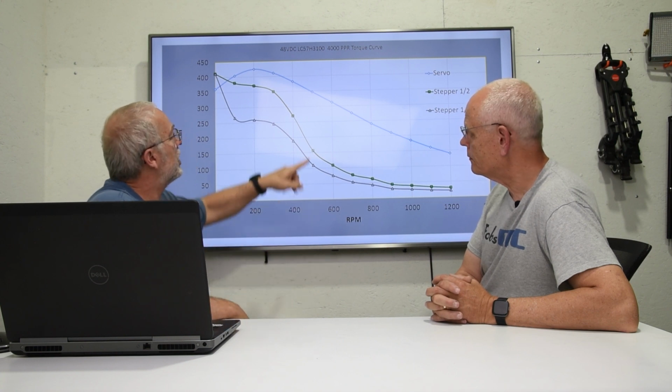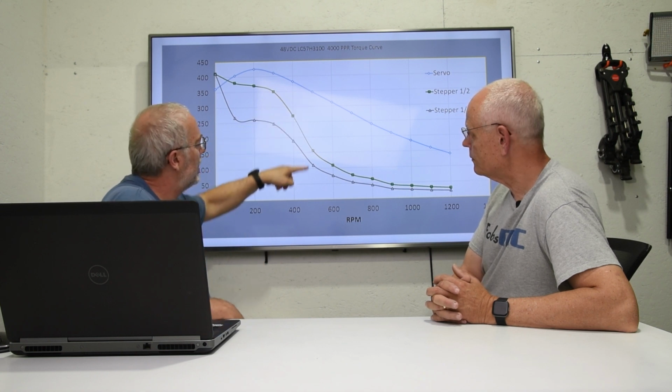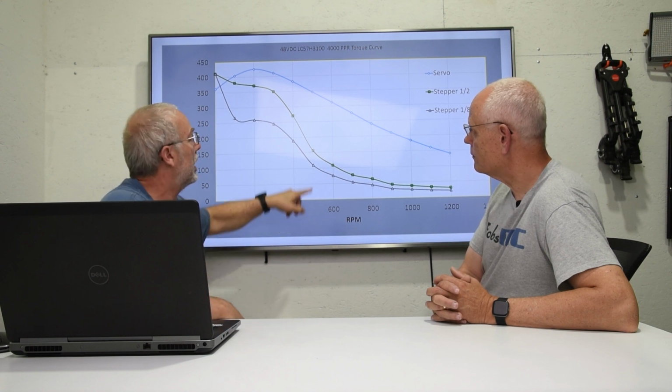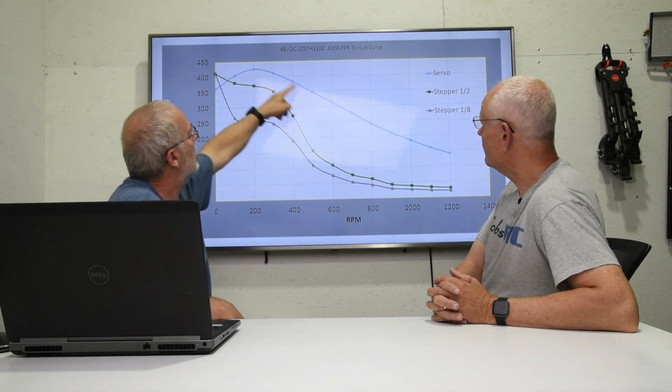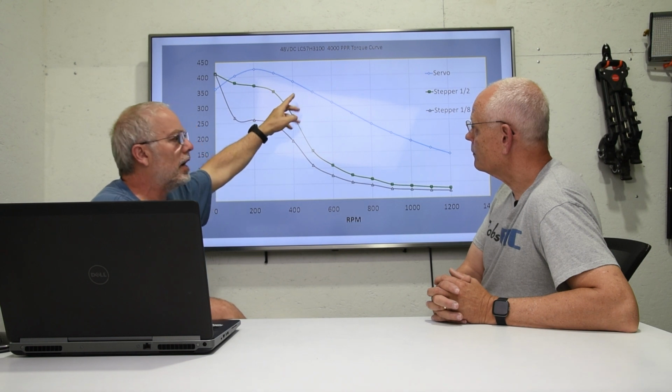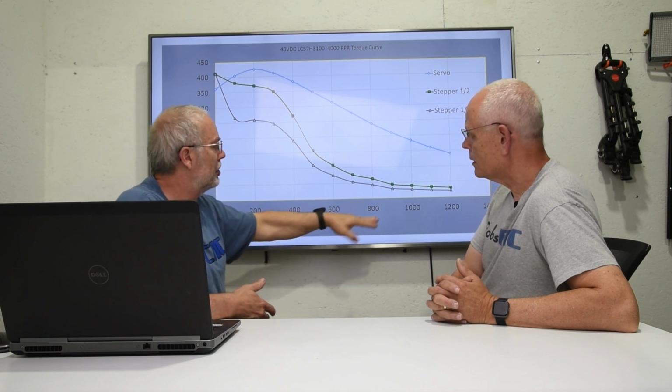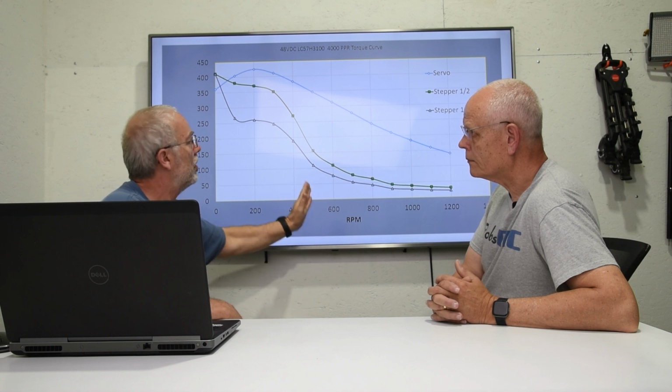So let's say for the KL7 series, we run at 1,000 inches per minute rapid. And you can see that for us, that's about the 500 RPM range. That's what it would calculate out to be. So I have lots of, I'm still in the major part of my torque curve. You could ask, why can't I run at 1,600 inches per minute? I would still be better than most stepper motors given that same size with the same current. The answer is really the microcontroller won't pulse that fast, right, with the resolution. So we want to keep it in the safe zone, and we thought 1,000 inches a minute was fast enough.